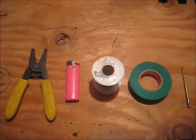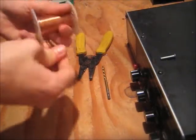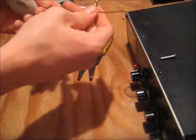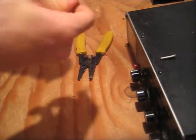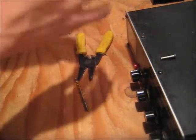14 gauge is about the best size. Step one for the lighter soldering iron is to take out some wire. Put it so there's about that much slack coming off the end, maybe a little bit less, and then coil it around eight times like this. Then take this spring that you've made with eight coils, compress it together and make it look nice and neat.